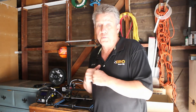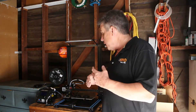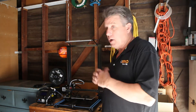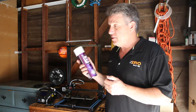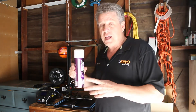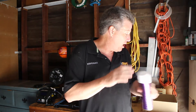You have a lot of choices for bed surfaces and adhesion — whether you're going to use glue or just use the glass. There are different mats you can buy. I decided to go with 12x12 mirror tiles, which you can get at any big home store. The IKEA ones are really popular. I use hairspray, and it's worked really, really well for me. One thing with the hairspray is it kind of goes everywhere when you spray it on the glass. What I did is cut a box out, put it on my bed, and spray inside it — it keeps the hairspray confined and keeps from getting everything else sticky.